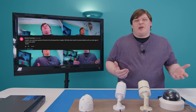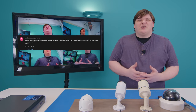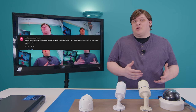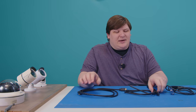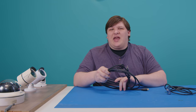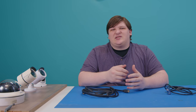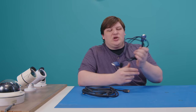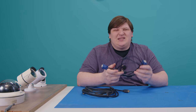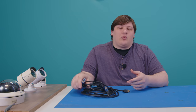It doesn't even have to be that big an application. I found this fellow on YouTube who's trying to put a camera at the end of his driveway — unfortunately his driveway is a thousand feet long, that's about 300 meters, and there really aren't any video technologies that'll go that far. Over the last decade, the only video interconnects that most of us have used have been HDMI, DisplayPort, VGA, and maybe DVI. With the exception of VGA, most of those won't go any further than about 25 feet without help, and usually you can't get much further than 50 feet without a signal repeater.